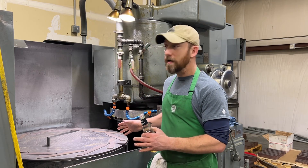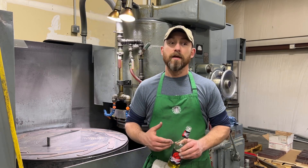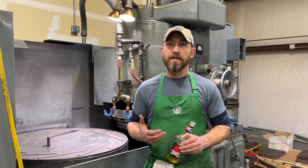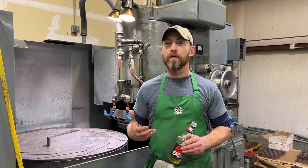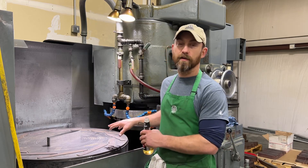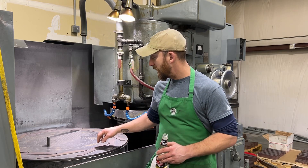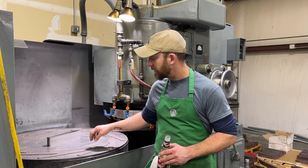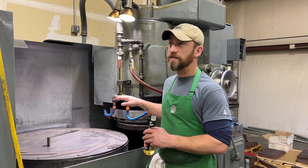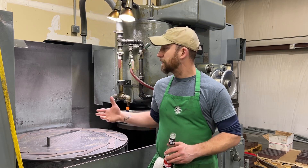So we invested in this machine — a Blanchard-style grinder. It grinds very differently than the table-style grinders, and we'll get into that in a minute. I think that for a lot of people, if you're looking for a surface grinder, maybe look at a grinder like this, especially if you're going to do blades, where we're really looking for a high degree of accuracy in thickness, parallelism, and straightness. I do believe this is overlooked a lot of times as an option that can do everything.